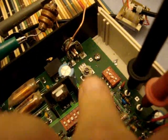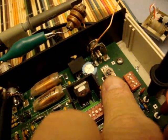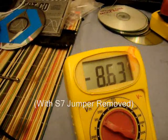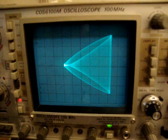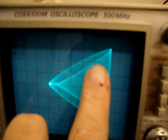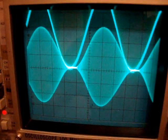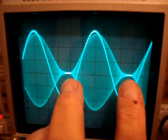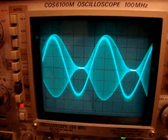The tendency is to take C5 right there along with the switches — you've got the inductors and C5 — and to tune it for maximum output. Let's see what happens to the modulation at maximum output. I'm going to tune this now for maximum output. 8.6 volts is about as high as we're going to get that at peak. Now we see a bunch of phase error — you see those loops? Those represent phase errors. The pinch off doesn't look real good there. Overlapping the sine wave on top of the RF envelope, you see how it's shifted? That's our phase problem. Will it sound okay? Yeah, probably. But technically, it's not correct.